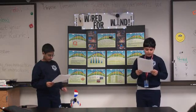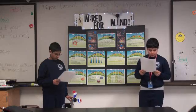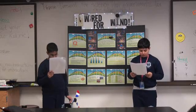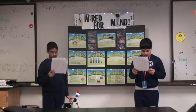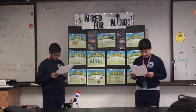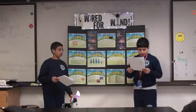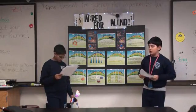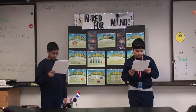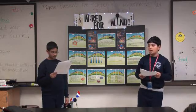Our materials were five 2.5 centimeter PVC 90-degree elbows, three 2.5-inch PVC T fittings, a 60-inch length PVC pipe, a 15-inch length PVC pipe, a 2.5-diameter DC motor, one hub, one simple LCD meter, one protractor, and 0.625-diameter wood dowels. We also used a saw, drill, scissors, tape, and a fan.